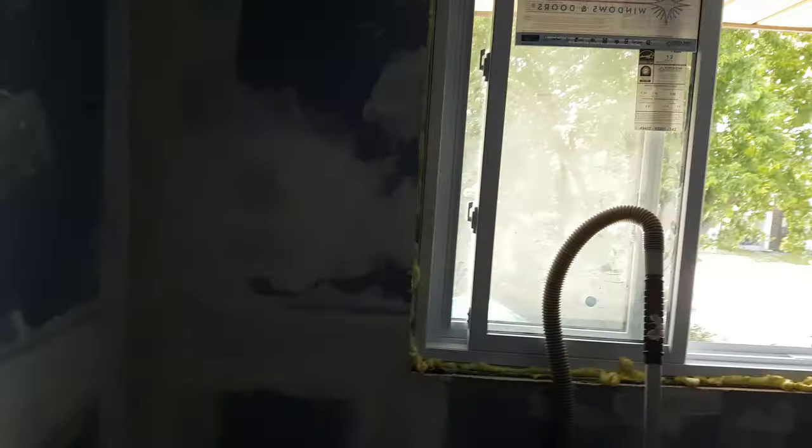Sorry, a little out of breath because I just finished scraping the floor. This is the second coat of mud and it's incomplete at the corners. This is the bevel or chamfer — that's the part of the drywall that's supposed to take mud, so there's a dip. On the second go-around I'm just trying to fill that up. The problem is I can't do the opposing side of the corner because the trowel would dig a huge groove in the wet mud.